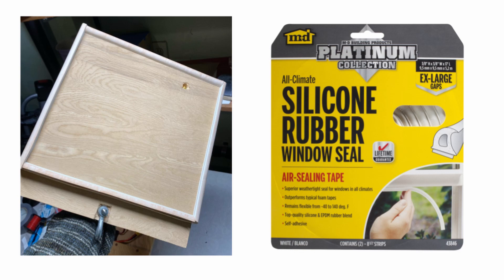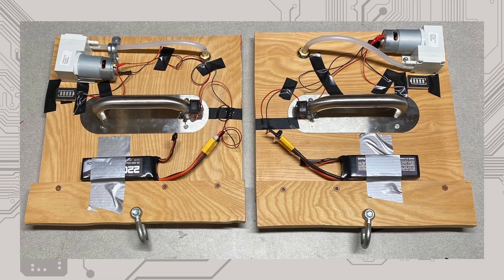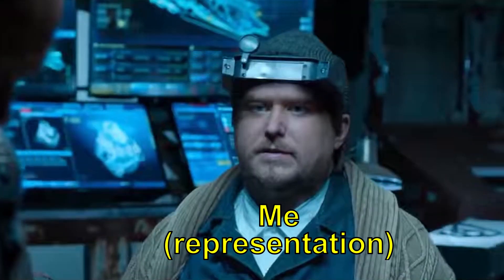Another important consideration was how much energy the user would have to put in. I decided to add optional foot straps — loops of rope with little PVC pipe pieces — attached to the bottom of each climber, so all the weight could be transferred to your feet, taking almost all of the physicality out of the climbing. The devices are actually incredibly simple, but I still ended up spending about a hundred dollars total due to buying things in bulk; a second pad would probably only cost around $35. The technical name is a portable vacuum-assisted climber, but I also like to call them Low Altitude Vacuum Seals — it's fittingly vague and sounds like the thing from Spider-Man: Homecoming.